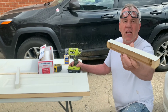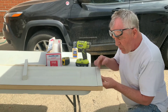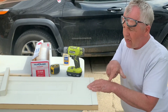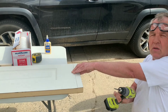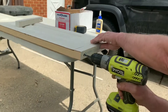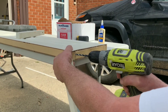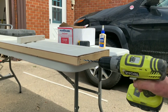Now drilling the pivot pin hole. What I've done is taken the block that I removed and I'm making sure I've lined up the grain and matched it up — just my double-check, double-safe system to confirm this is exactly the one I cut off. So I'm using the existing pivot hole as a jig — this is my jig to mark exactly where this pivot goes. I'm just going to spot it. I need a bigger bit and I don't have it handy, but now it's marked so I can drill it on the job site.